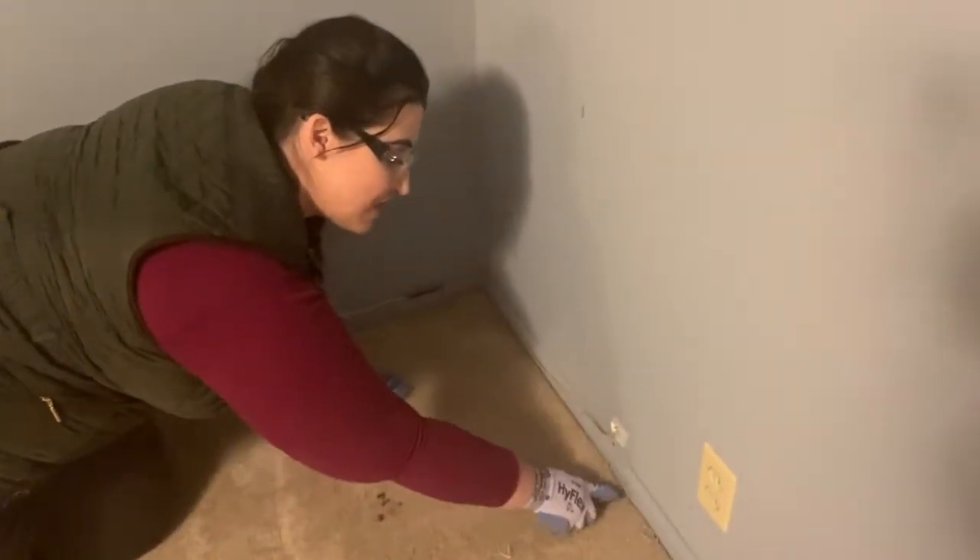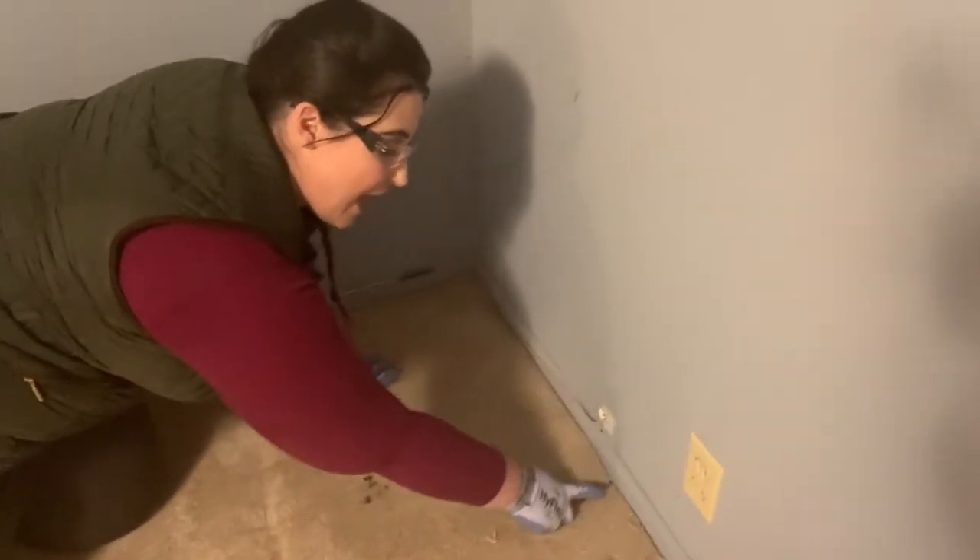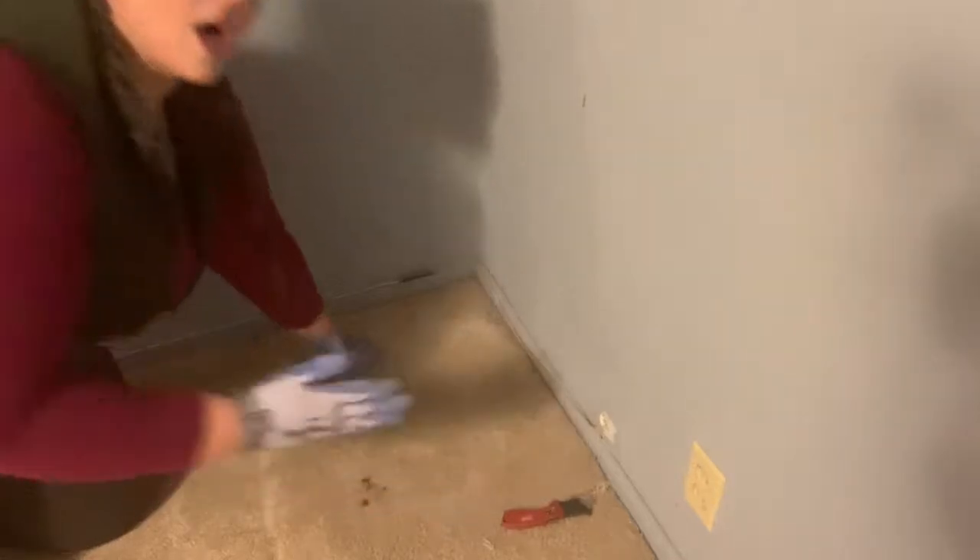It's time to start cutting up some carpet. All you really need for this is a box cutter, and sometimes if the edges of the carpet are sticking, a pry bar to help get it off the floor. I also like to use some cut-resistant gloves just for safety since I'm working with a blade, and safety glasses - with these old carpets I don't know what's going to be under them. Your first step is to find a small section and start cutting strips. I like to use smaller sections because as you pull it up and roll the carpet for the whole length of the room, it's going to get pretty heavy fast. Small sections are easier to work with and easier to maneuver as you're taking it downstairs, around corners, and out of the house.